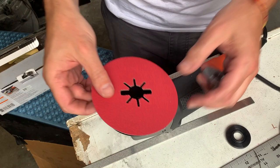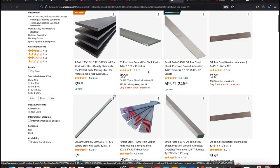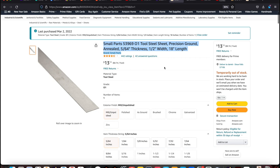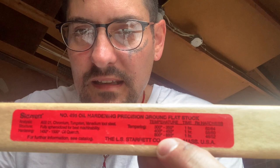Take off the guard that's normally on the disc — it won't fit — and remove the bottom metal pieces that normally sandwich the disc. You don't need them. To make a quality blade you need quality steel. I would highly recommend Starrett; they've been around a long time. You can get it on Amazon in the industrial and scientific section. It will be annealed and tell you how to temper it and at what temperature. The package has a red label listing the steel type, quench method — O1 is oil — and your tempering temperatures.